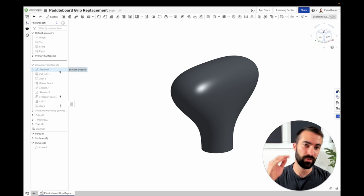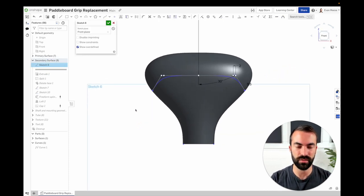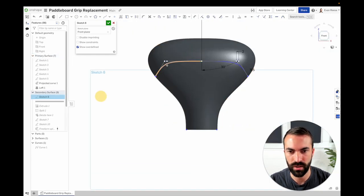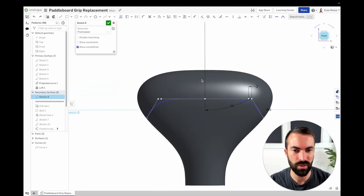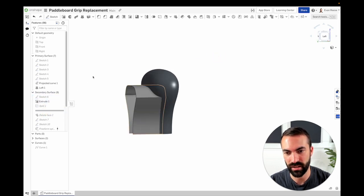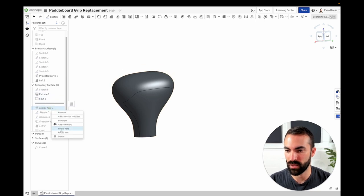With the main shape in, it's time to develop that scoop for the fingers. I made this shape — you're seeing some blue because I want to leave these things editable so I can play with them. This is slightly offset from my input curves in sketch one, and uses more Bézier curves. This shape is symmetrical. I could use the split feature directly, but I'd get it split on both sides of the surface, which I don't want. So I made an extruded surface and split with that, ending up with just this on the one side where I want that scoop.